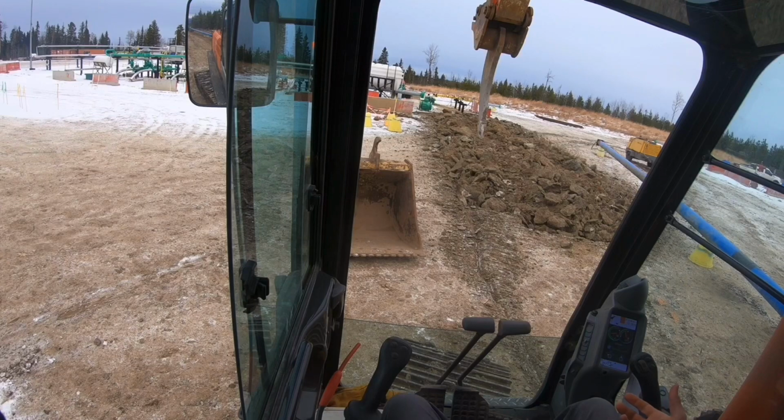Typically in the winter, you get about a foot of frost, but when you drive on it, it goes deeper. I've seen it as deep as 9 feet. So that was 3 feet, and that was only about a week of driving on it. So it happens pretty fast.